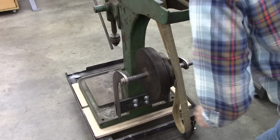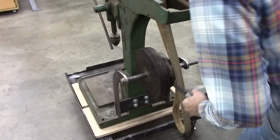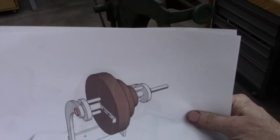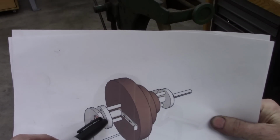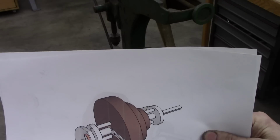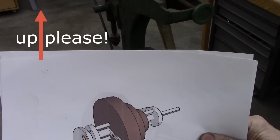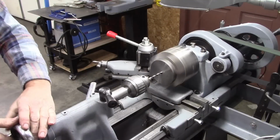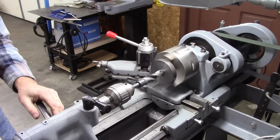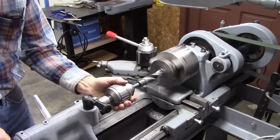And this goes right there. Still got to drill three holes in that. Just a little refresher. I gotta bore holes in that and key it, cut some keyways, and then slots in the shaft to disengage the pulley and slide it. A lot of work to do. Drilling this to 7/8 of an inch, and then I gotta open it up to 1 inch to fit that shaft.